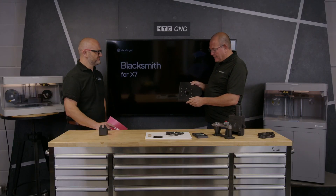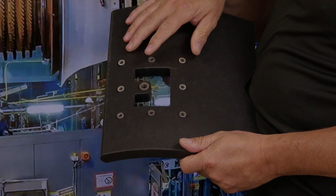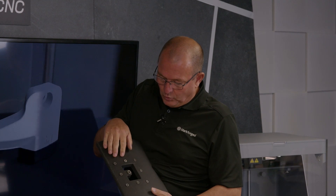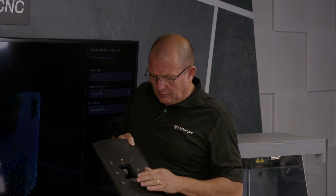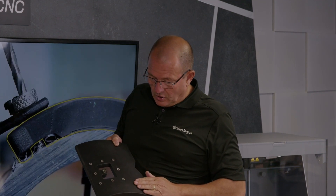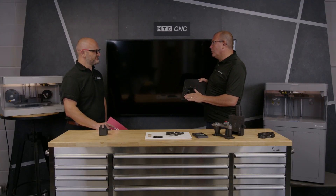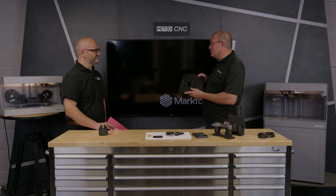This used to be made out of a block of aluminium, and we got challenged to see how accurate we would be compared to a CNC machine. Hole number eight — and I love five-axis CNC machines, they're wonderful things, they're expensive but they're wonderful pieces of equipment — that hole was within 10 microns in X, Y, and Z. We got a little bit of drift on some of the surface, but using the Blacksmith item on the X7 compared to the CAD model, we could train the printer to print the jig they wanted perfectly.